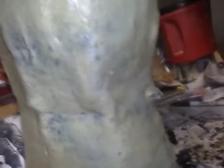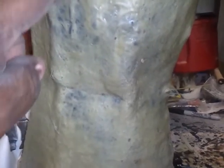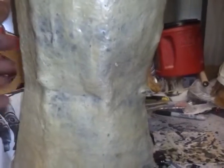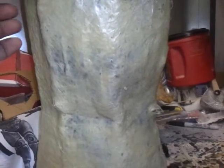The purpose for that is it's intended for when you're laying up fiberglass at a right angle — the resin has a tendency to drip. What the body filler does is give it a little more stiffness to prevent dripping, and it gives it more elasticity so that it doesn't crack as much.